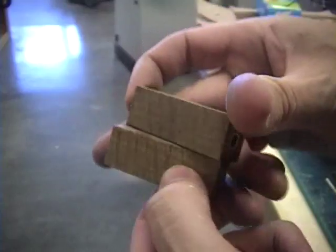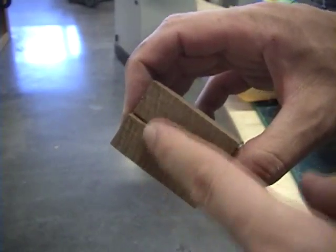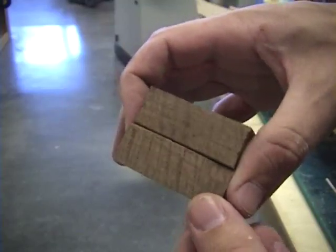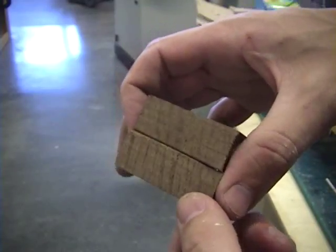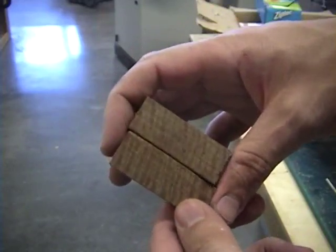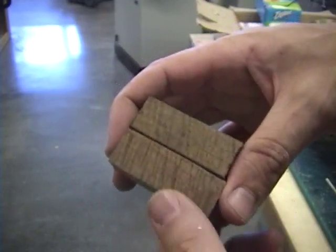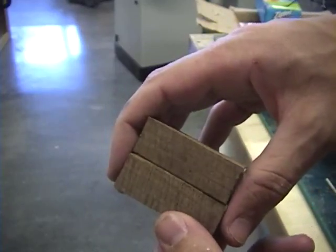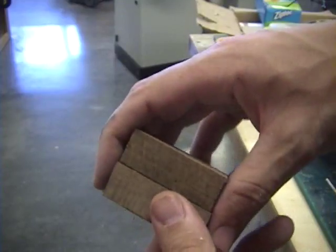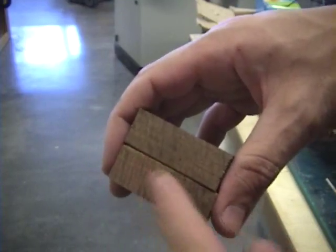Constantly pull out the drill so you can keep checking to see if you've hit the brass or not. Okay, I chose this particular piece of wood because of these lines that go this way. As you tilt it, it does this shifting of the light, reflecting it back at different angles. And that's going to stay there even after I turn it around. The pen is going to be kind of holographic, and it'll look really cool. I call this a fiddleback.